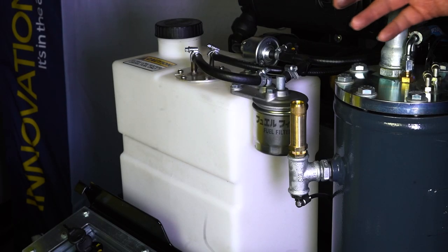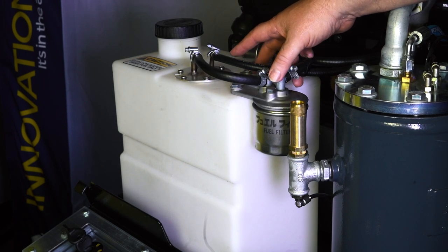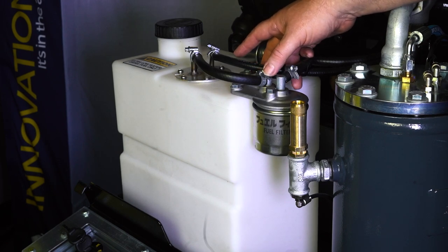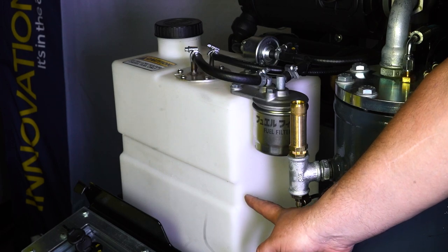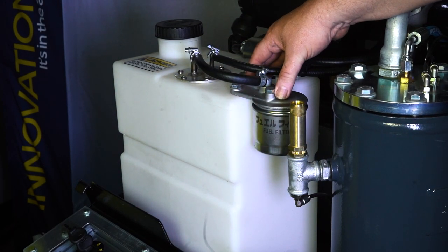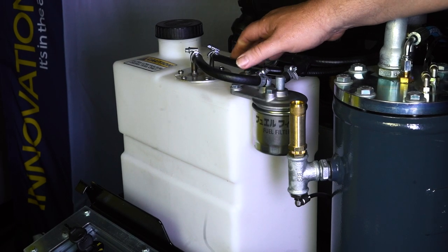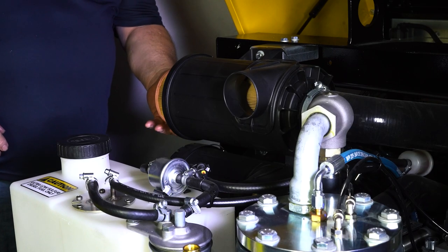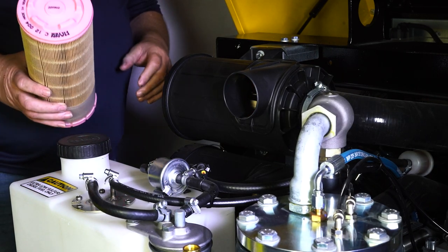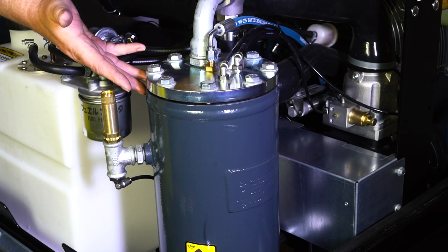This is our unit's fuel tank. The fuel tank is composite so it's durable — it won't crack, won't rust, and it's see-through so you can actually see the fuel level. It's a large tank at 11 gallons, giving us eight hours of run time. All filters in our unit are equipped with MAN German-made filtration, from the air filter to the oil filters.